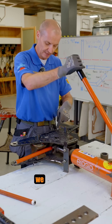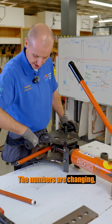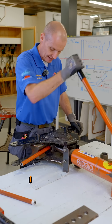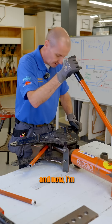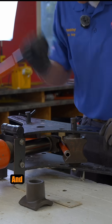Now we bend it — we can see the hydraulic ram moving through, the two pipes are getting pushed back, the numbers are changing. I'm on about 25-30 degrees now, so I keep going. I can always check from above to see the angle, and now I'm just checking — I'm at 60 degrees, keep going.